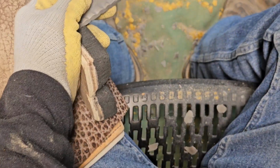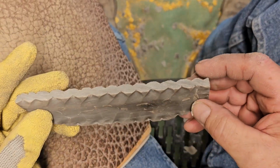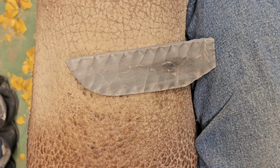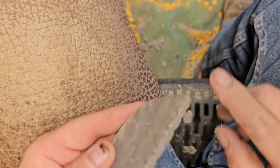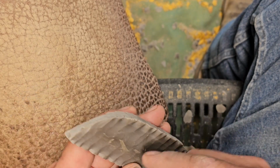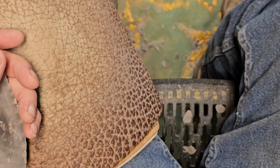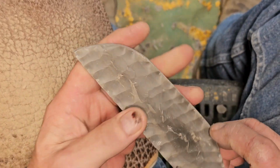So we've got our slab, the initial pass done. So now I'm gonna set up the camera and go over there, and I'm gonna grind this. And what we're gonna do is I'm gonna grind all the way around this, and I'm gonna take all these deltas down. You'll see, but I'm gonna give this some convexity, basically the finished convexity, and then I'll nap over that, finish the edge, and it's done. So not a lot to it, but I'll take you over to the grinder and we'll get to grinding.